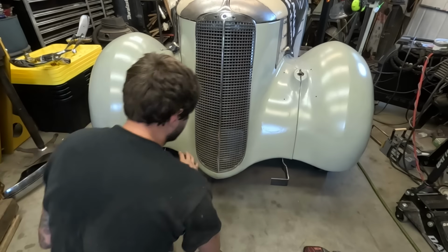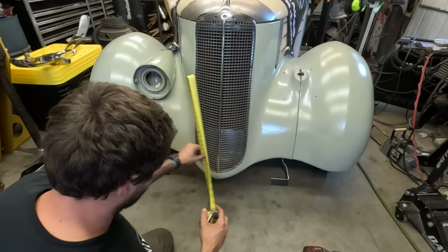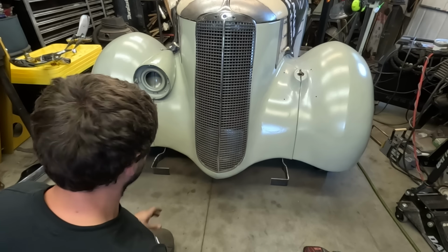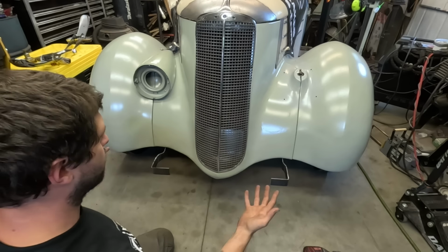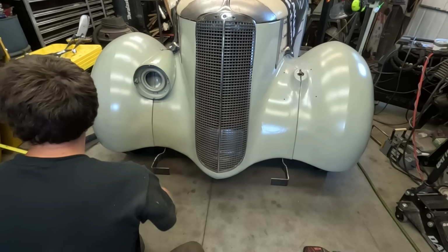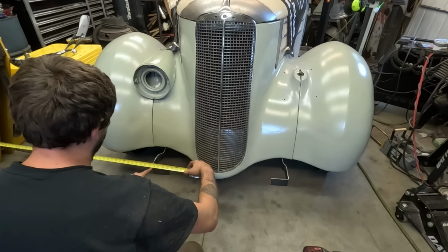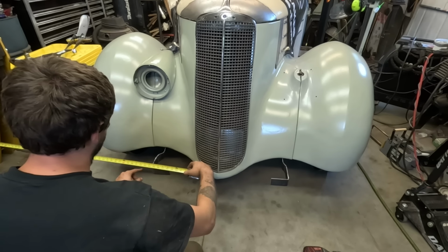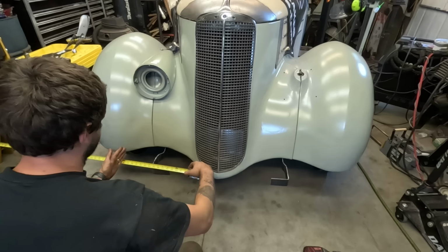Right now, these bumper brackets are at 13.5, 13.5, the same height to the floor. Bags are all the way up. There's tension on the bags up. Everything's square. I'm using the Bailey English wheel as a marker. So I'm gonna grab the end of it, 54.5. I'm gonna move it till this is 53. So I'm gonna move it 1.5 inches out.